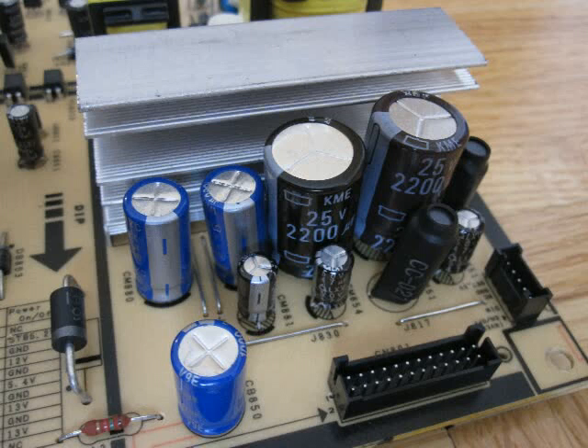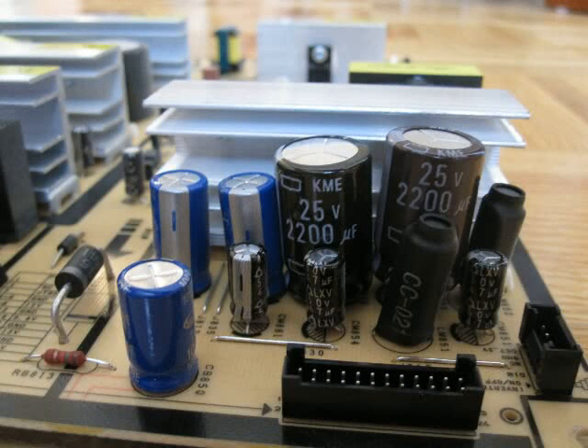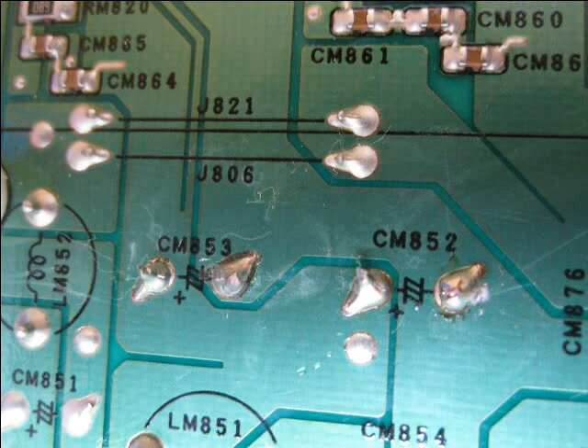You can see the gray stripe with the minus sign on it and the short wire lead, and the long wire is the plus that goes to the plus side. The only downside is the size of the replacement capacitors is much larger compared to the old ones. I couldn't find anything smaller but fortunately they did fit. I tried to keep them away from the heat sink. My soldering job is not perfect, but it got the job done.